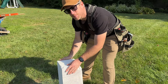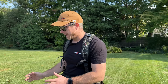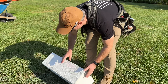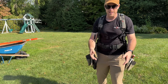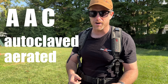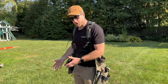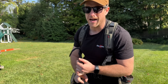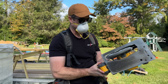We have this brand new material we've never used before — it's called a Handy Brick. Handy Bricks are made by NCP, who also makes Adornstone. It's a concrete block, 8 by 12 by 24. You'd think it would be pretty heavy, but it's not — it's lightweight concrete called AAC, autoclaved aerated concrete, infused with air in the mixing process. It creates a really lightweight concrete we can use as building blocks for kitchens, benches, columns, and all kinds of stuff. It just glues together.